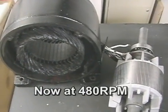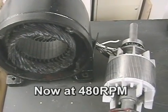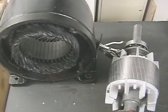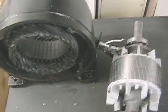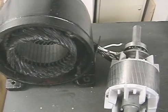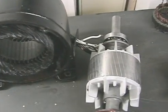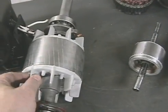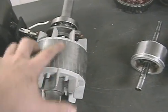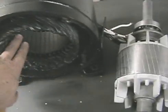This design will make power at 700 RPM, and if I wire it right it'll make 240 volts. I've lit four 100-watt bulbs with it — no problem — it makes plenty of power. It does create a drag, but as you can see there are no magnets in this. It's basically an eddy current being created by the aluminum on the ends.